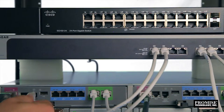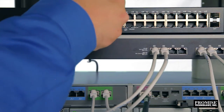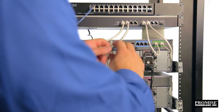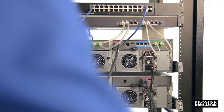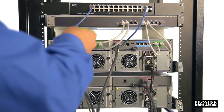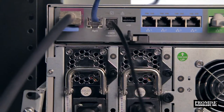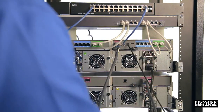Connect the management ethernet port. Connect the RS232 ports. Although seldom used, these ports can help with serial debugging by connecting to the internal CLI. If your host computer does not have a DB9 serial connection, you can use a USB to DB9 adapter.